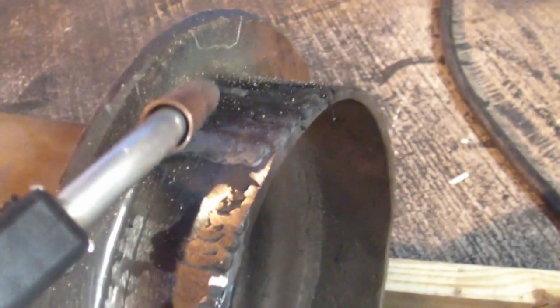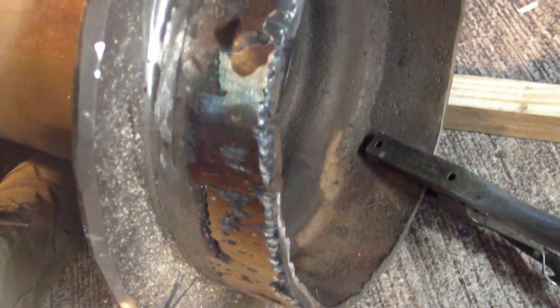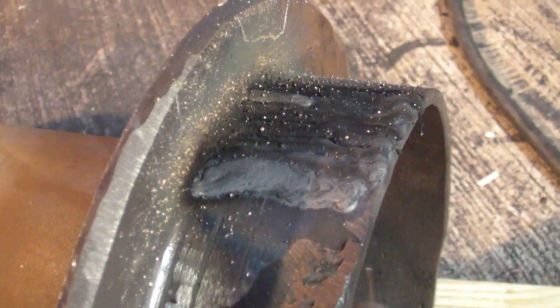What we're doing is we're cladding this with silicon bronze because it's going to rust if it's left as cast iron — it's not going to keep any paint because this is where the brake rides. I had to repair a large part that was bent inward from the gears being banged on by stuff, and that went so well I decided we'll do the whole thing, then grind it round again and take care of some rust problems.